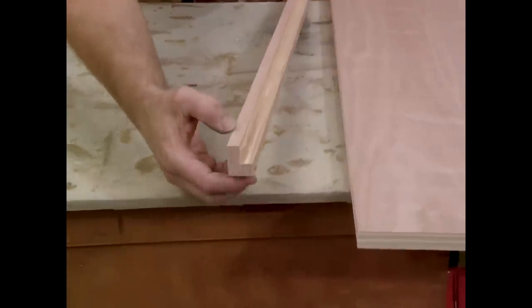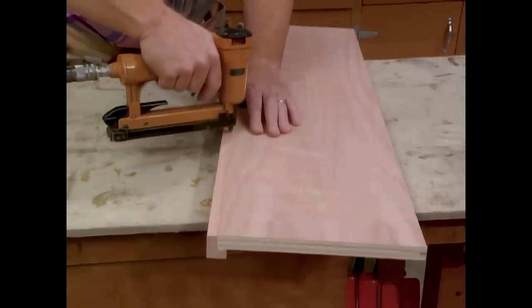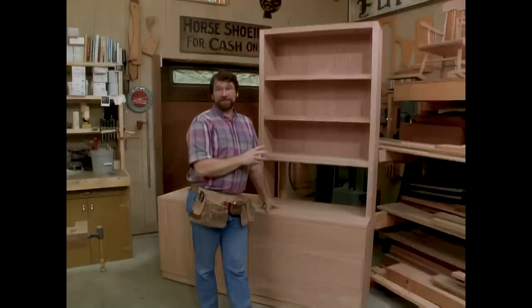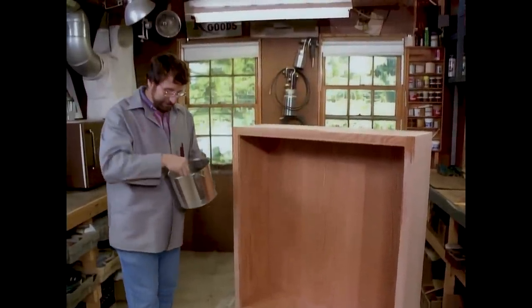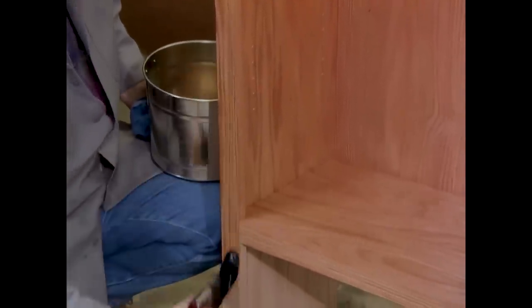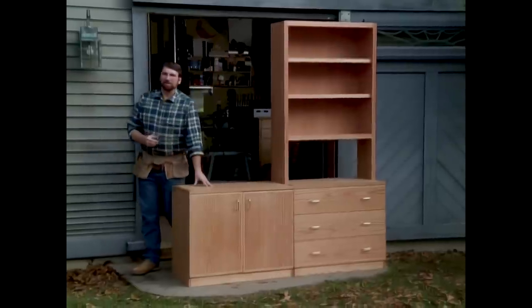All three shelves are made exactly the same way — a piece of three-quarter-inch plywood and an oak edge. I've rabbeted out a piece of one-inch oak so that the shelf will just fit into it. Not only does it provide a decorative edge, but it adds a lot of strength to the shelf to keep it from sagging. Now a couple hours of finish sanding. I'll dust it off and we'll move it into the finishing room. The challenge for the finish here is to end up with something so tough and durable that even a student couldn't destroy it. So what I've chosen is to start out with a coat of sanding sealer. After that's dry, I'll give it a light sanding and put on at least two coats of a tough gloss polyurethane. I think these storage units turned out very well, and they can grow up with a child from grade school right through college.